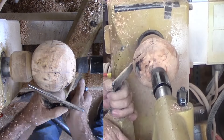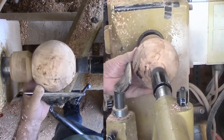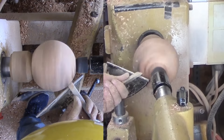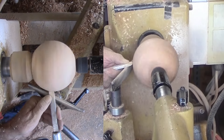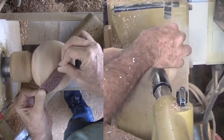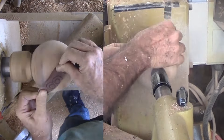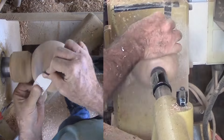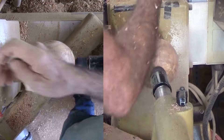Then mark a new equator line and rotate again for more scraping action. I am going for a fourth rotation — new line and rotate again. This is rough, hard wood. Next, the sanding rotation starting with 80 grit sandpaper. Three rotations with each grit; may be more with the 80 grit as it's still refining the sphere. The remaining grits each get three rotations to cover the complete sphere but only remove the scratches from the previous grit. Dust collection and/or protection is essential.